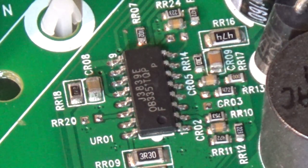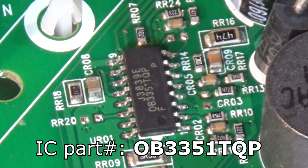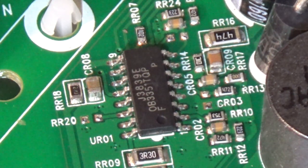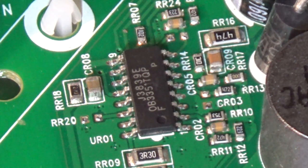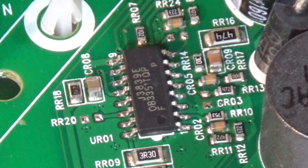I'm going to remove the capacitor and resistor to test them out of circuit and see if the capacitor is open, the resistor is open, or the capacitor is shorted. It could also be this IC right here — I read about 4 pins going to ground. I couldn't find a datasheet for that part number. The markings look partly erased — possibly burnt up. It looks like it might be a TQP part but I couldn't find anything matching, such as a 33501 or 510CP.